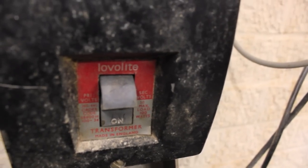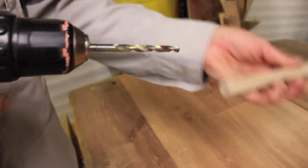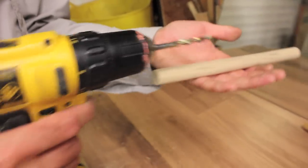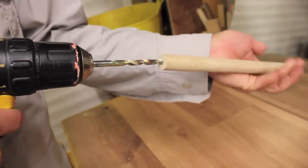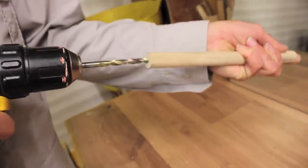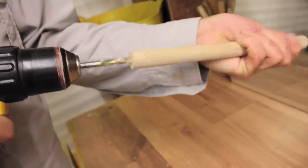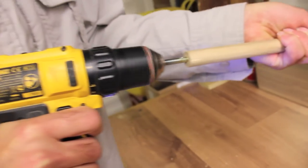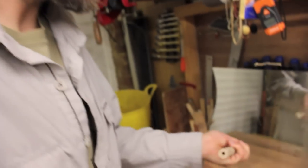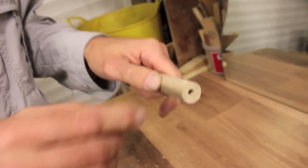Now I'm changing the drill over to the six millimetre. Holding the dowel freehand has some risk of slipping, so hold it a little further away and start gently, making sure the drill is biting in at the end and still rotating nice and true, then clamp up on the dowel. Getting rid of the waste is really important. I can see there's a little bit of worm frass - woodworm has been in this piece of wood - so I'll want to trim that back.